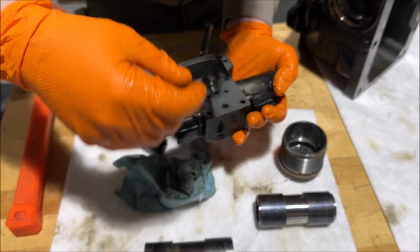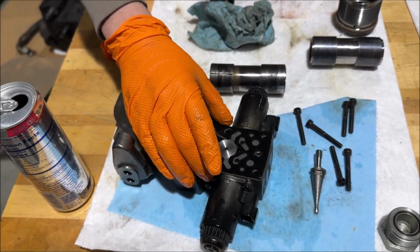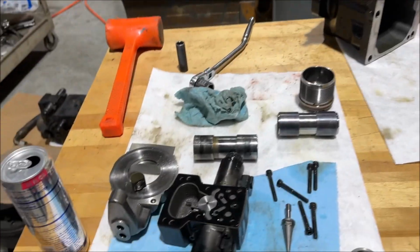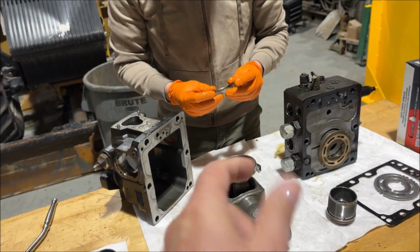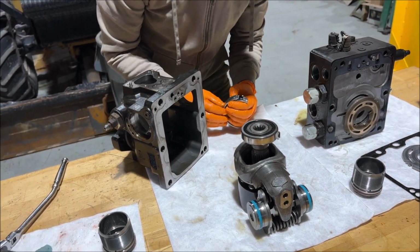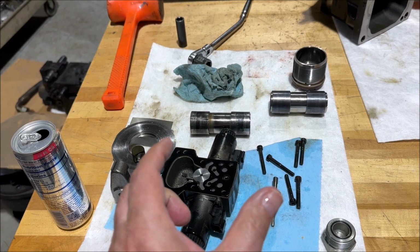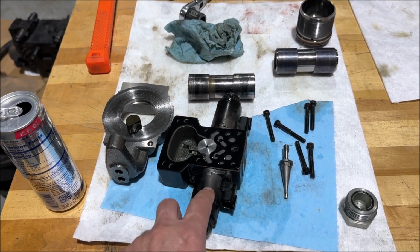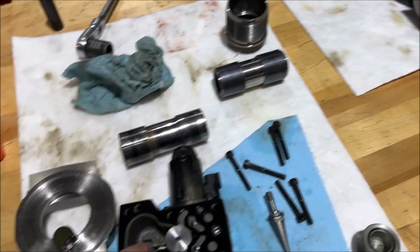on the blade. Now these solenoids are not just a normal electromagnet. They're designed to be pulsed, and what the controllers are doing is they're sending out a square wave to these solenoids that has a variable amount of length. So it might be just tiny little spikes if you're just trying to move the machine forward really slow. If you want to go max speed, then the square wave is just on all the time. So it's the gap between the waves in the square wave. It's called pulse width modulation, and that's what you put into these things, and that's what they send the oil to those pistons. A little feedback loop here.